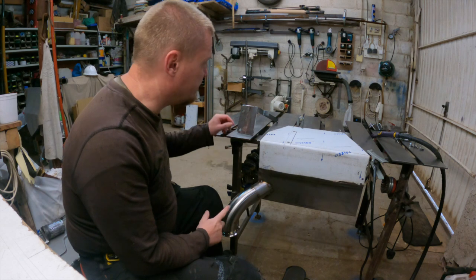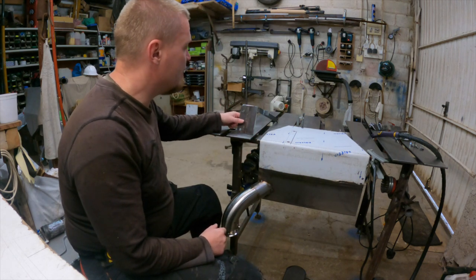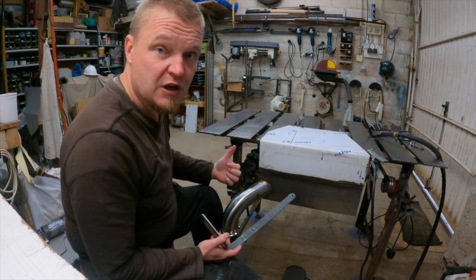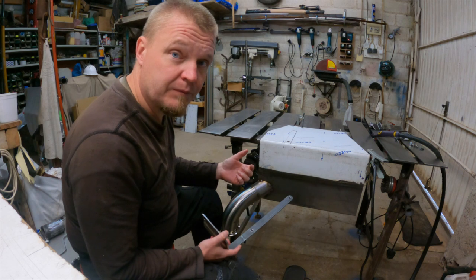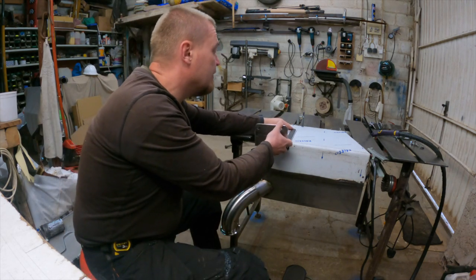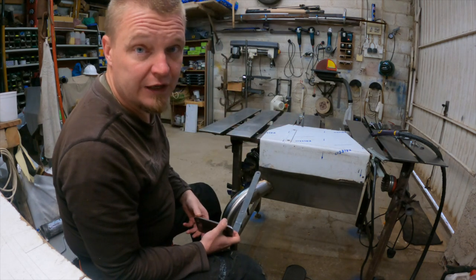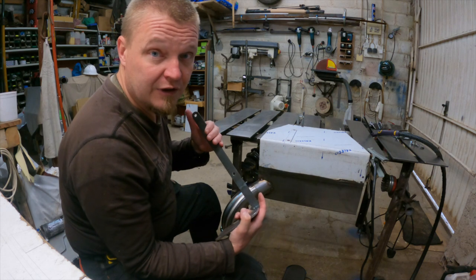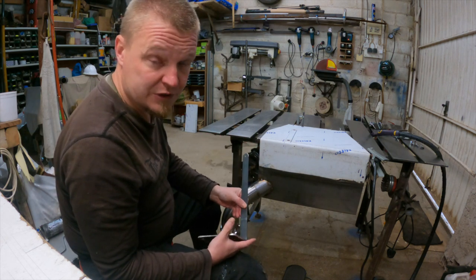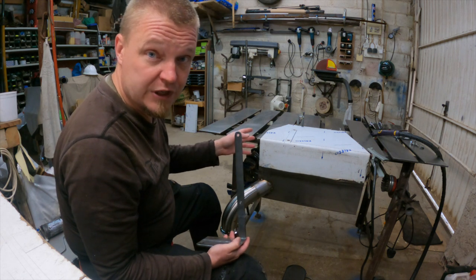With the pipe tacked well into the box, there's a few things I need to do or want to do before I start making the internals of the box. One of those things is that the box needs to have captive nuts, otherwise you'd have to snake your hand in through the exhaust and hold the spanner in there, and I don't think that's really very feasible. So I need to weld on some nuts behind these so that when you come to put the box on the truck, you can just put the bolts in. And to make that a little bit easier, I also want to make a little bit of a lip thingy on top of there so that you can just put the box on the bracket and you don't have to worry about it falling down and trying to hold it with four hands or four arms. So that'll make it a little bit easier. So let's do that before we start thinking about the interior decoration.